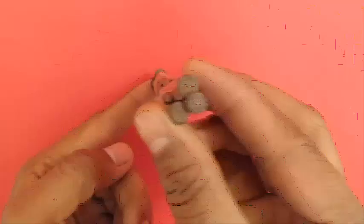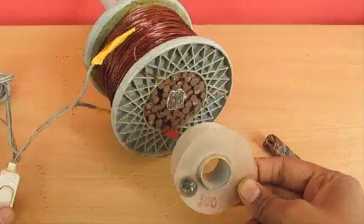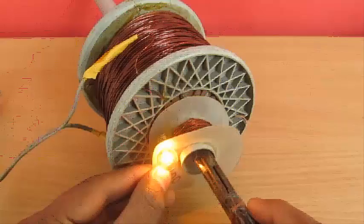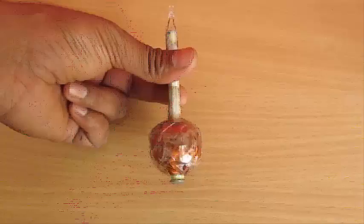We have wrapped these nails together and we will see the effect of a strong core. If we bring a coil with 100 turns, see how dimly the bulb is lighting. The moment we put this core inside the secondary coil, the effect is hundreds of times bigger because the magnetic field is now concentrated.